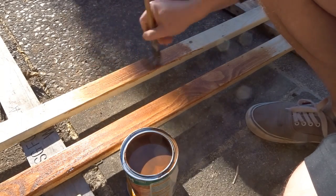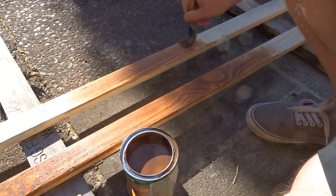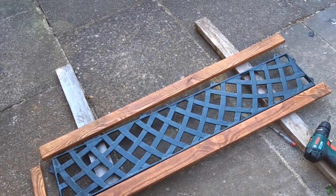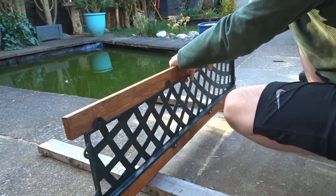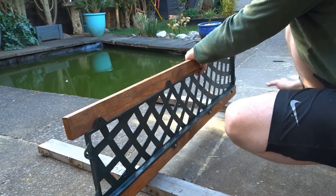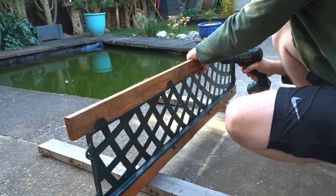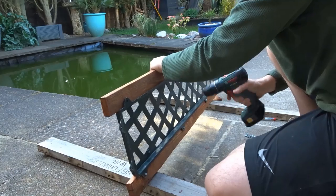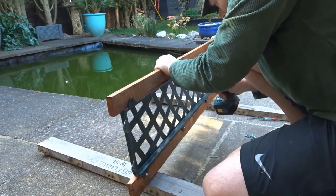And be careful of the knots as well. One piece that I cut had a knot right in the middle and it really weakened it, so I had to use a different piece. So you can see I stained it there with some teak stain, and it gave a nice colour. I could have given it more coats to darken the colour, but I thought it looked nice just like that,